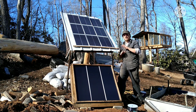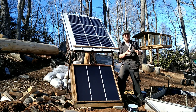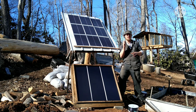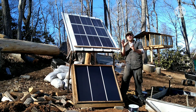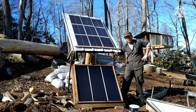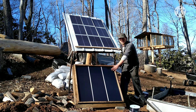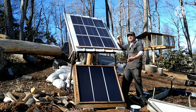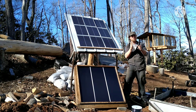What you need to do is set them up facing south. This one can move, but that is not required — facing south is good enough. The other thing you need to be aware of is that the pitch of the sun will change. In the winter you want these real steep facing south; in the summer you want them almost flat. So factor in some way to adjust them, whether with posts you pull back to change the pitch, or something like a winch cable to yank it back. Either way, get your solar panels set up with plenty of sunlight, facing south.